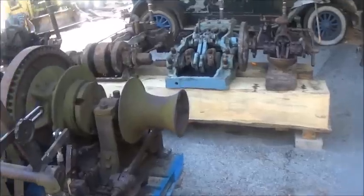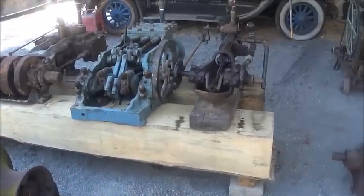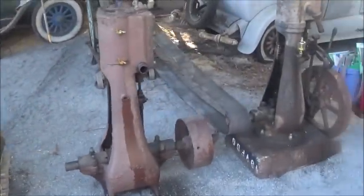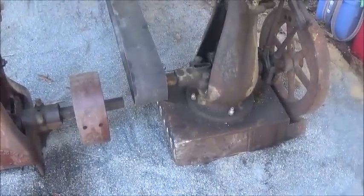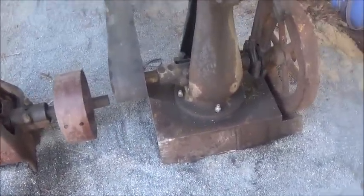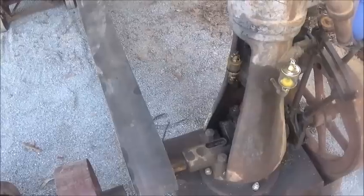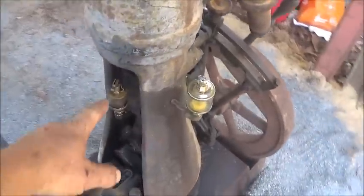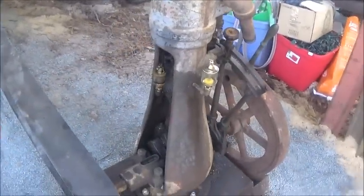All that running I did yesterday - started about 8:30 and didn't stop until about 4:30. But I didn't film not one thing. We're going to do that today - I'm firing again next day. We figured out everything we've got problem-wise. These have got to be concreted down - there's no way around it. They move too much, even the one on the big base. Every engine's got things that need worked on. This one here, packing is leaking terrible on the bottom side of the rod. Not bad on the valve, but that's fine - that's an easy fix.